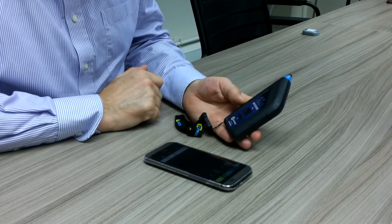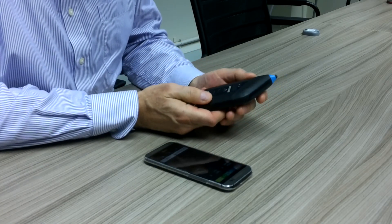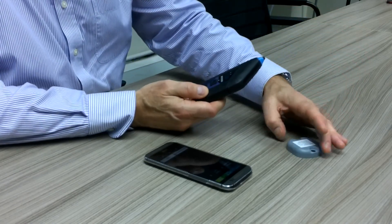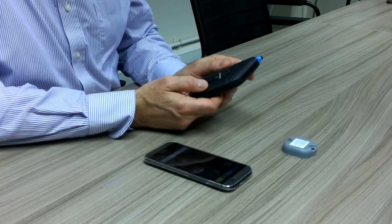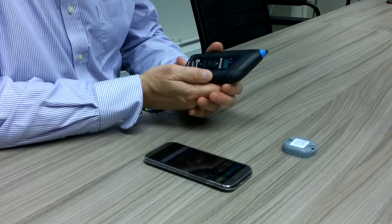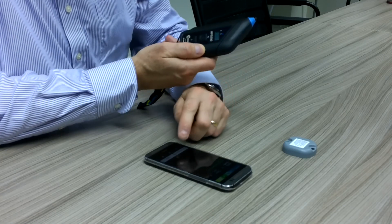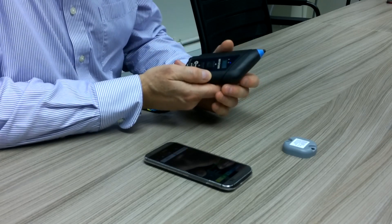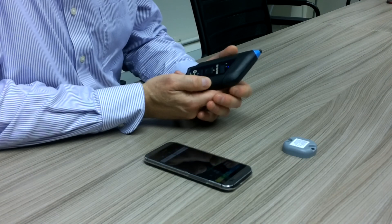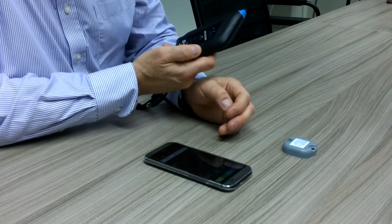I will press the device again on my screen and for demonstration purposes we can check a reading of a tag. I bring one of the UHF RFID tags nearby, press the start inventory button, and I can see the tag being read on the screen. I press stop inventory and the tag code has appeared on my screen. I can then clear and read other codes.